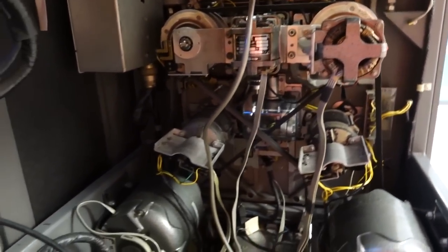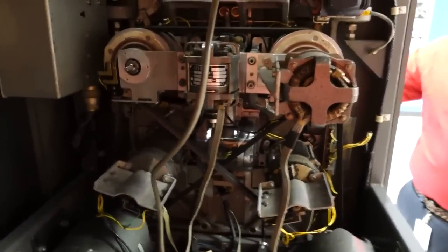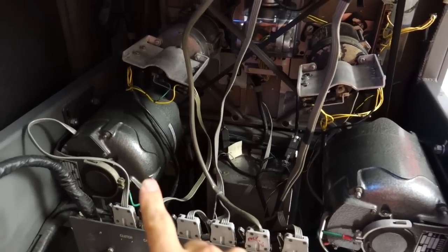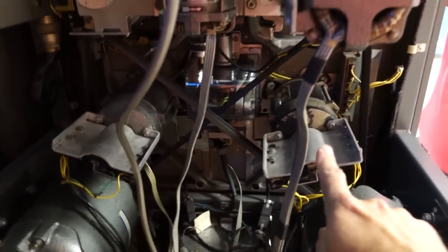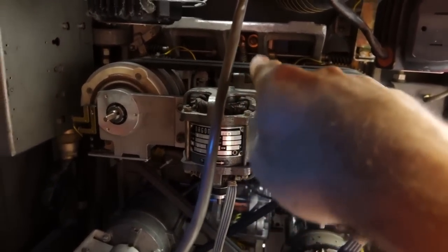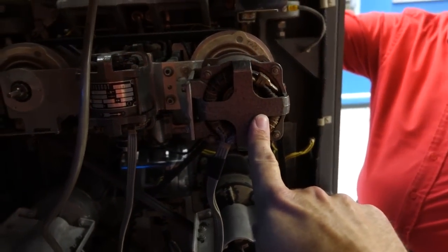So to make that tape work, there's no less than 8 motors. There are the 2 motors for the main hubs, the 2 motors for the capstan, the one that actually moves the tape, 2 motors for loading the tape, 1 for the fast rewind, so that's 7, and down there, I don't know if you can see it, a super big one that's for the vacuum. So no less than 8 motors to make that thing work.